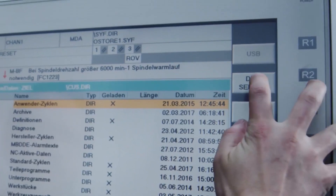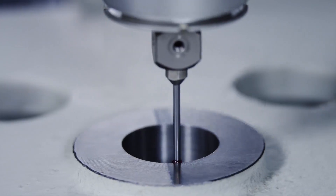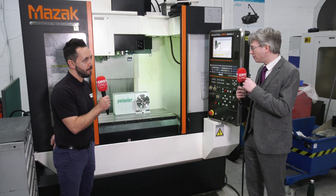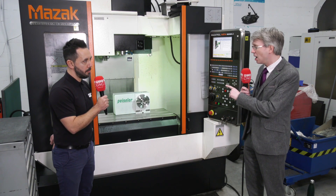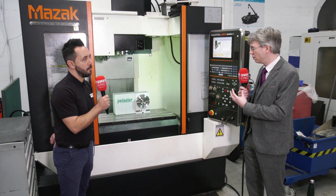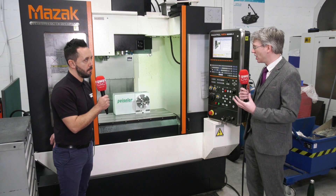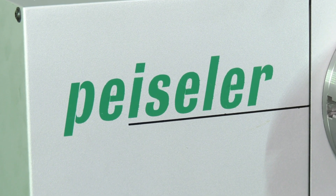The unit we see here is an ATC 160. The designation doesn't indicate the faceplate size, which might confuse some people, but it's a nice compact unit. This version has the 4-plus-1 rotary manifold on there, so if we want to get services through the rotary table, that gives us that facility — for example, if we were putting on an auto fixture, very similar to the trunnions that Brown and Holmes are quite renowned for.